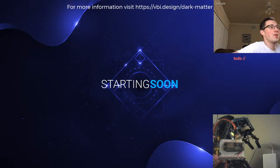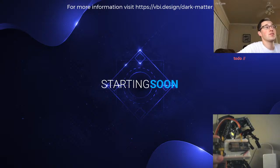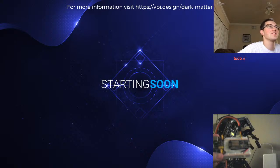And that's really cool because we can connect our phone to it. Moreover, we can connect a browser as well. But moreover, it can run servers. So I can connect to this ESP32 over Wi-Fi, and then I can have this ESP32 deliver web pages. When it delivers a web page, we can throw some JavaScript in there, some HTML, CSS, whatever, and then we can listen. We can host a server on this guy as well, and it does a lot. This is some neat stuff, and this essentially becomes our backend as well.